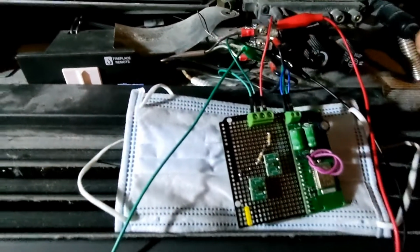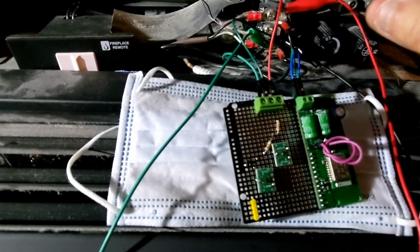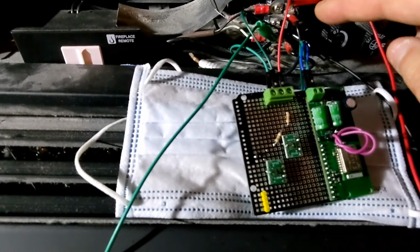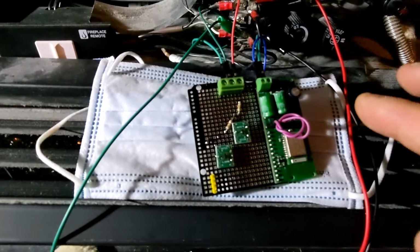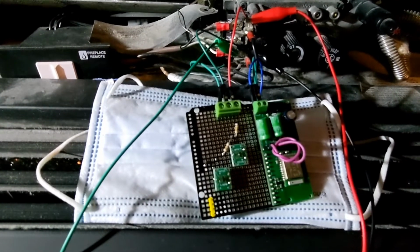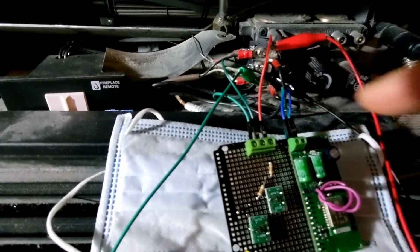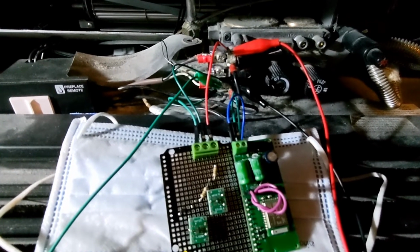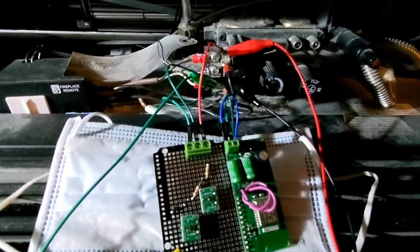So the way it works is there are 3 terminals in your valve, and they hook up directly to the sensor. 2 of them are the thermopile that generates the power. So in parallel, we'll pull power from it to the sensor. The sensor will harness the extra energy that is not used. And then there is one terminal that is controlling the switch to turn the fireplace on and off.